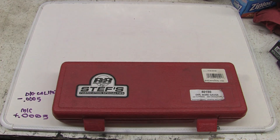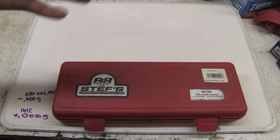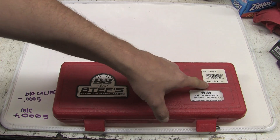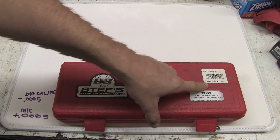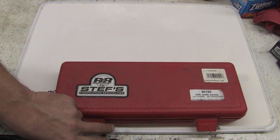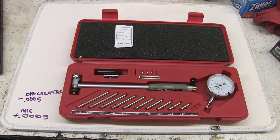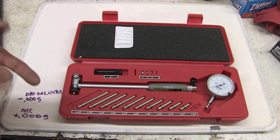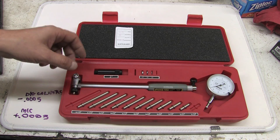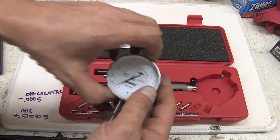Or anybody who's a machinist. If you have a good machinist, they're going to have one of these in their shop, they're going to base their measurements off it, and they're going to know how to calibrate it. But if you want to see what's involved with getting an engine checked out, follow along with these videos. This is for internal use only — it actually is correct. What this allows you to do is measure the inside bores of bearings, cylinder walls, and things like that, quickly and accurately to as close as a ten thousandth of an inch.